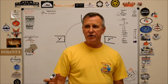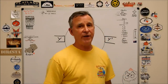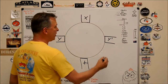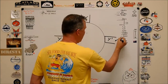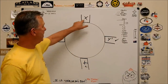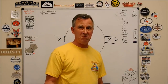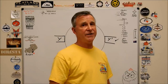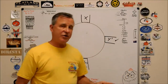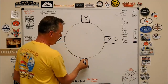If you plan to say, okay, I have a bunch of round pieces I'm going to do, and I'm going to do it just as fast as you can in a three or a six jaw, and here's the secret. We are going to leave this one alone. We're going to leave this one alone, and we're only going to unlock X and Y each time we change a part. Will that work? Yeah. Is it conditional? Yes, it is conditional. It's conditional based on the fact that this diameter doesn't change because you have these registration points here and here.